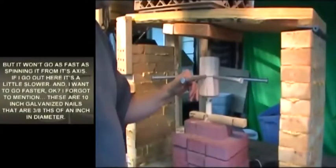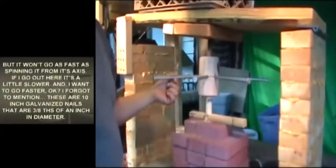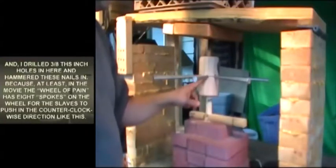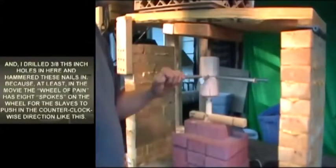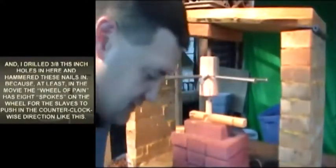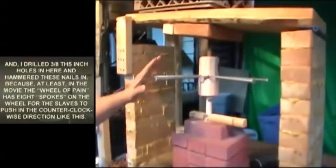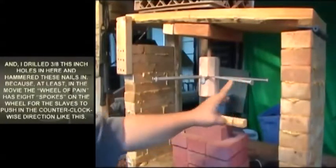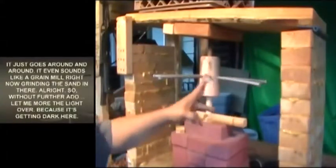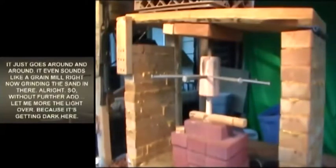I forgot to mention, these are 10-inch galvanized nails that are 3/8 of an inch in diameter, and I drilled 3/8 inch holes in here and hammered these nails in, because at least in the movie, the Wheel of Pain has 8 spokes on the wheel for the slaves to push in the counterclockwise direction, like this. Just goes around and around. It even sounds like a grain mill right now with the grinding of the sand in there.